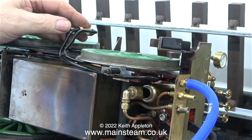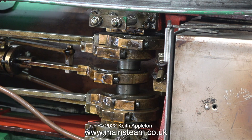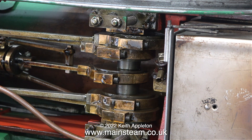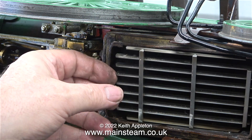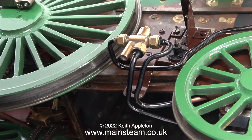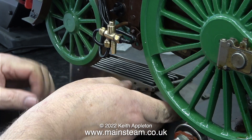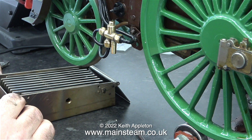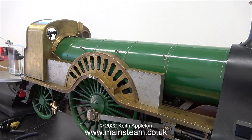While the engine was on its side, I thought it was a good opportunity to give it a thorough coating of oil — and I was surprised to see that it was fairly oily to start with. With the engine in this position, it was very difficult to fit the ash pan with the grate inside it, so temporarily I removed the grate. The ash pan is quite a tight fit between the two axle box horns, so I think I'm going to modify it slightly. It's really important with a miniature steam locomotive to be able to immediately drop the fire if you get a water feed problem, so the last thing you want is an ash pan that is a tight fit.